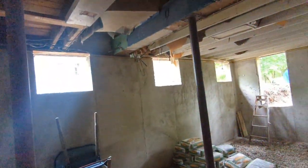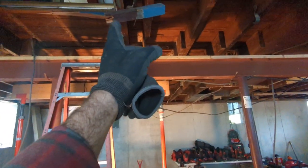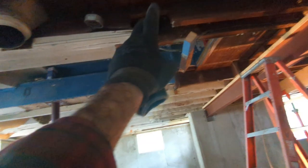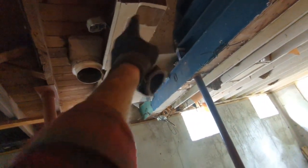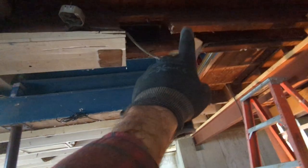And then I can have these shores back, which I'll feel better about coming over here. I just threw this permanent column into a temporary position right here as well, because I noticed that the stairwell has got no joist there, one, two, three, and then there's a full joist, but then immediately the next one has a huge bite out of it for heat, which is why they had trouble here. There was a lolly column there and a lolly column there, and this big cracking, broken plank, because it's so thick, trying desperately to hold this area up because it's just too light to be collecting all that load. So I'd like to get this piece cut off there and take the rest of it away and uncover this plank and uncover that solid joist and clean them all up on the sides.